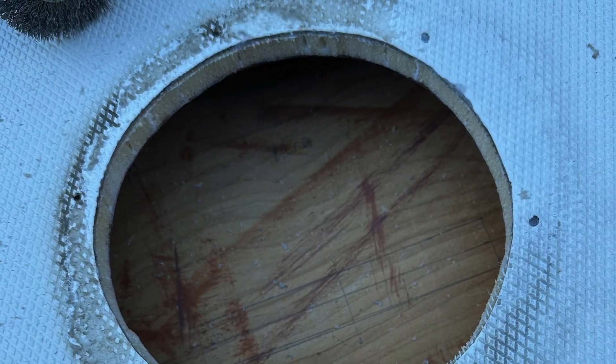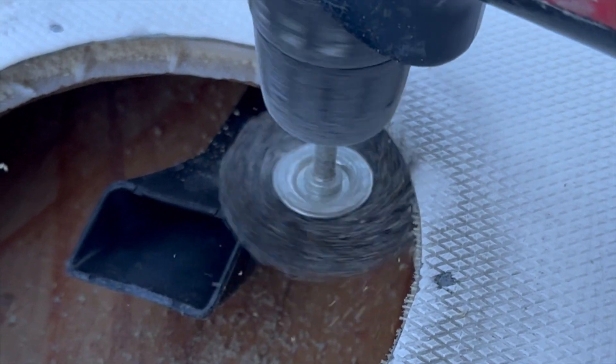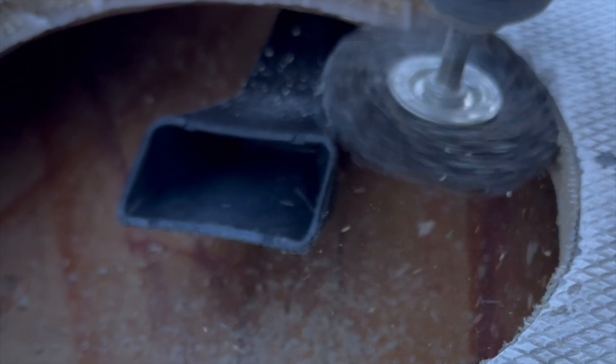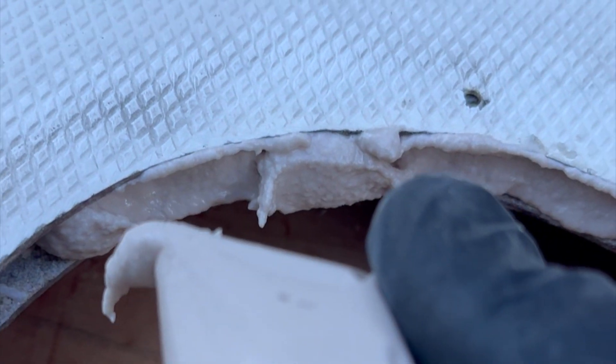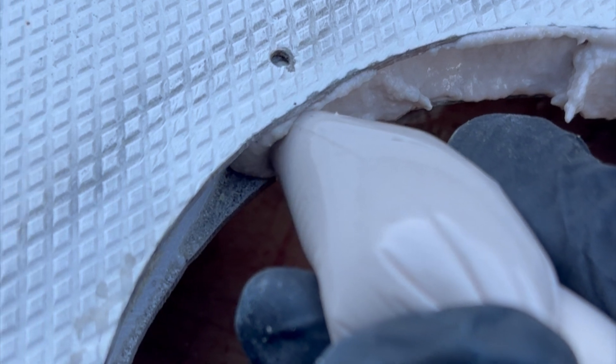The final step was the inspection port area. The foam was cropped out and epoxy paste was injected into the circumference to further ensure watertight integrity of the newly laminated part. Upon removal of the inspection port, this was the downfall of the original product.